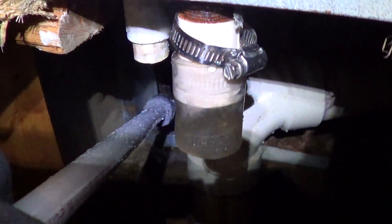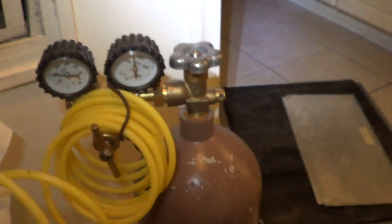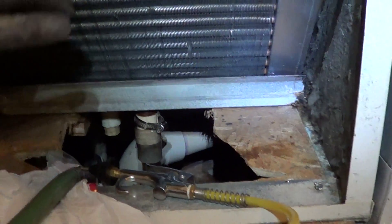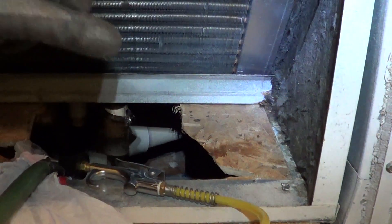What I have to do is fill the standpipe just a few feet up and then use my nitrogen, which is high pressure — 200 psi. I made a little hole in my hose so once my standpipe is just a couple feet high, I give it a blast of the nitrogen and then that water hammers the clog.